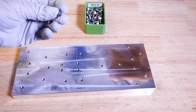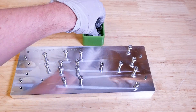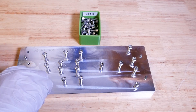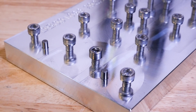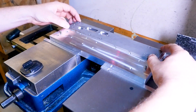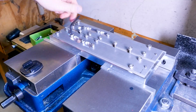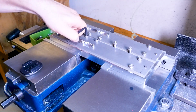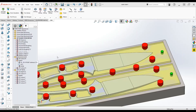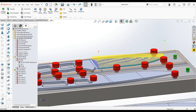These little dowel pins are critical for accuracy. All the threaded holes are going to be used for bolts to clamp down the stock but these are going to be used to position it. The holes I'm sliding them into are only one thousandth of an inch bigger than the dowel, and the same is true for the holes in the blade stock, so when we move the knife from the first station to the second we can be sure our knife is going to be in the perfect position and we're not going to have any misaligned features on either side of the knife. Here you see me positioning the blanks onto the dowel pins. Once they're down they don't wiggle at all because of the tight one-thousandth of an inch clearance between the pins and the holes, so after we bolt the blanks down they're not only rigidly held — which is what the bolts do — but they're accurately positioned, which is what the dowel pins do. It's critical because the CNC machine is going to blindly machine the bevel in this exact spot every time, so if the blank is sitting crooked or uneven the bevel and all the other features are going to be machined in the wrong spot.